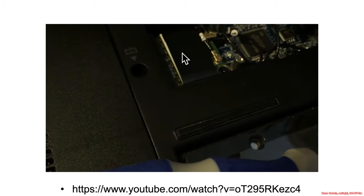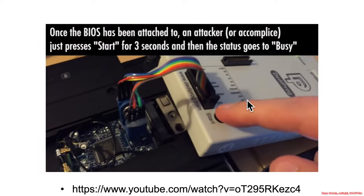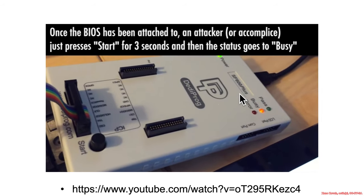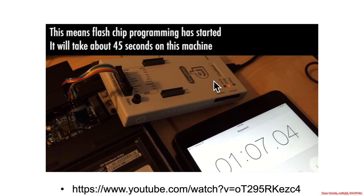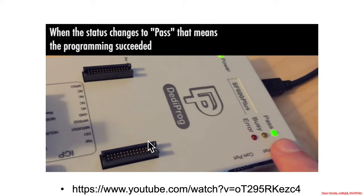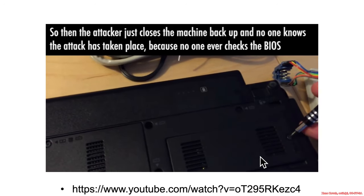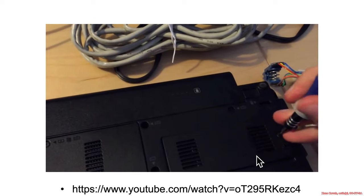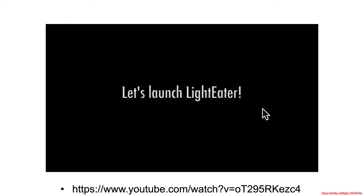Also there's an embedded controller, Wi-Fi, Bluetooth, stuff like that. As I carefully try to clip on with one hand while recording with the other, this particular Dediprog — the SF600 Plus — is nice because it has the capability to actually preload a BIOS onto it. That's why it's not connected to a computer; it's just got power and a preloaded BIOS. Within about 45 seconds after pressing the start button, it goes ahead and rewrites the BIOS. The attacker can just close this back up, and there's no evidence of physical tamper because you just clipped onto the chip for a little bit. The grand total of the attack using one hand only took a minute and 30 seconds. If you want to see the particular proof-of-concept malware that was injected into that code, you can go watch the rest of the YouTube video.